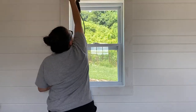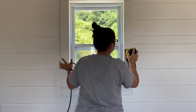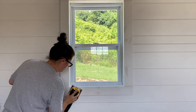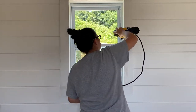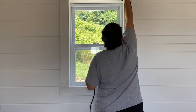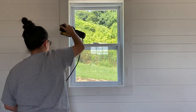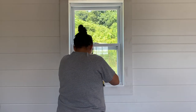Here I'm going in with the sander to sand everything down between coats. I did not use a rough grit sandpaper — it was just taking off a light layer of the caulking. I tried to smooth it down as much as I could with the baby wipe so this process would be a little bit easier, and it actually turned out okay. Then I went back in with the second coat of caulking, sanded again, and then we painted everything.